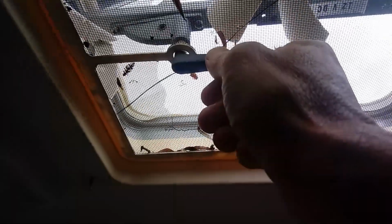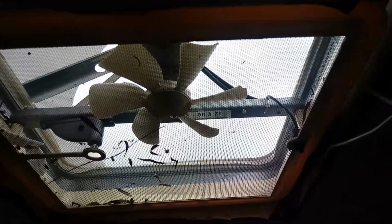The other bolt that you have to remove is you got to remove this handle, and there's a screw right here, and you take it off this way. To take this screen off, there's 2 small screws, a Phillips head screw. Goes one there, and then there's, you see that, one right here. So I'll remove those 2 screws and remove the screen.